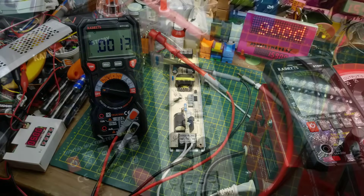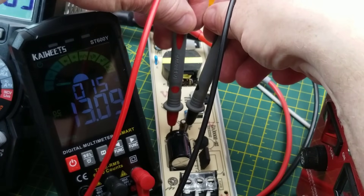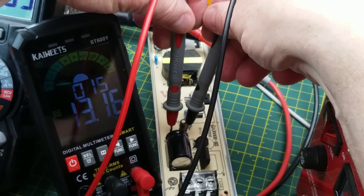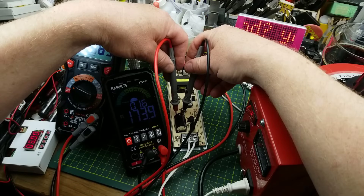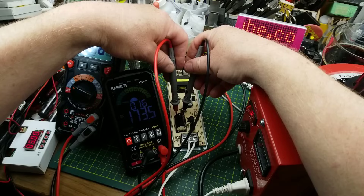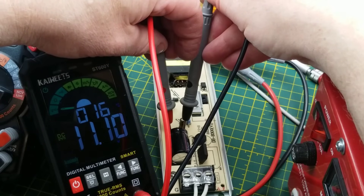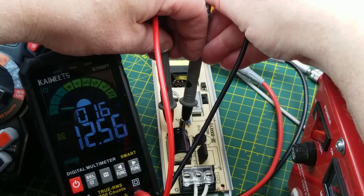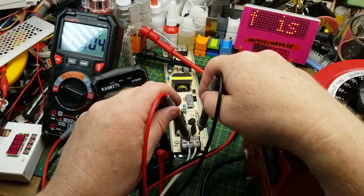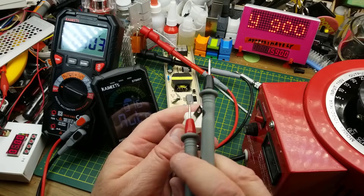I didn't see a discharge resistor across that big capacitor. Look at that — it's like 13 volts across that capacitor and it's shut off. When the thing's running there should be a lot more voltage on there. At 125 volts AC, fully bridge-rectified and smoothed, that makes sense. When we shut it off, it drops down to about 10 volts almost immediately, then climbs back up slowly even though there's no input. But it doesn't back-feed through the bridge rectifier, so the input side is still safe.